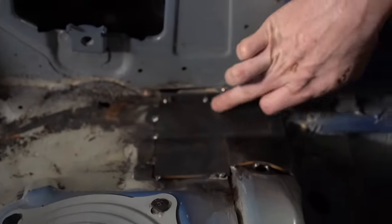Our next tube to do is the forehead bar. It goes across between the two half laterals. Doing this tube is probably the only one that I don't actually plug into my computer, measure and pick up points and do. I do it really simply. I cut a tube straight. I notch both ends on the angle that I want, but I make the tube just a little, about an inch longer than what I actually want it to finish out at.